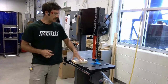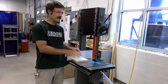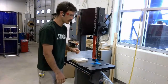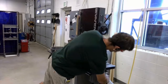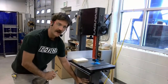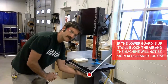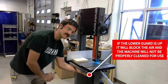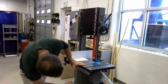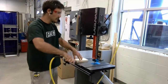The first thing we need to make sure we're doing is cleaning the machine correctly — not only cleaning above, but also cleaning below the table. I'm going to grab my air hose and use it to blow off under the table. To clean under the table, the lower guard must be in the down position, so if it's up, I've got to lower it down before I can clean. Then I can clean under and above the table.